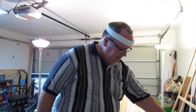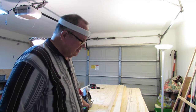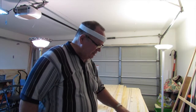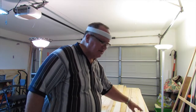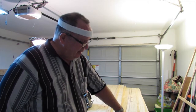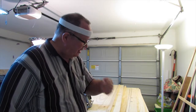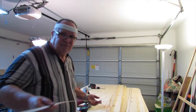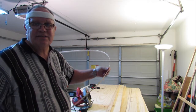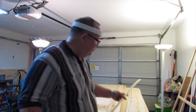and set this over here 3 7/8 inches. Now, I set it 3 7/8 all the way down, made sure that this piece was straight. Everywhere I got a screw, I made sure that was 3 7/8 inches off the milled edge of my plywood. And then I took my saw and I ripped that down. And what I ended up ripping off was this little flimsy piece of wood here. This is my off cut here.